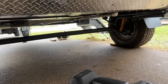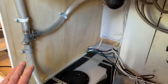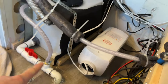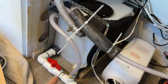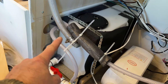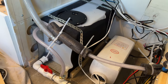Let me show you the plumbing. I've got my drain tube coming from the sink down to the gray tank, with a drain out of the tank, a vent on the opposite side from the shutoff — so if the tank fills too much it'll still drain through the overflow. My water line is in flexible tubing to try to reduce noise, though it's still really noisy.